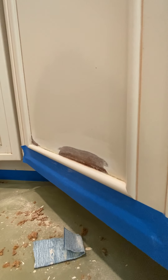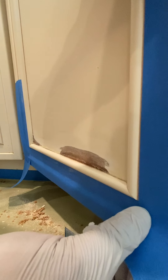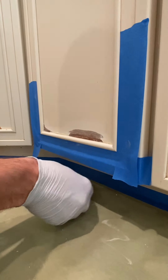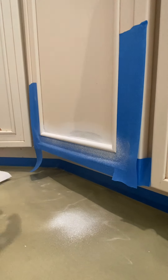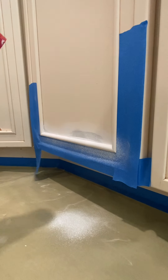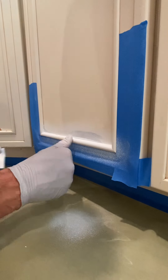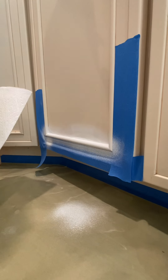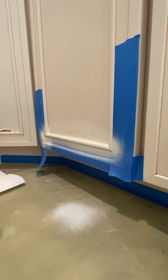Now we're ready to spray. First, we mask off the frame of the door since there's no need to paint the entire thing. I'm putting the tape right over the edge of the glaze line, which makes touch-up a lot easier later on. Then we hit it with primer — a couple of coats, really building up that area and sanding in between to smooth it out even more. If I had the opportunity to do this door in the shop, I'd do a lot more coats of priming and sanding using machines to get it absolutely perfect. But doing it on site in a house, this is as good as it's going to get.